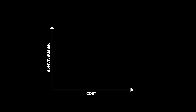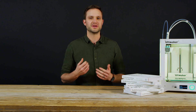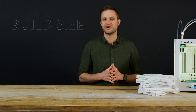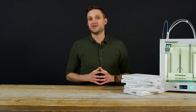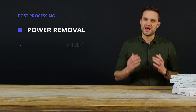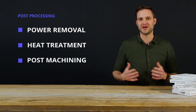In simple terms, metal 3D printing is really only justified if you're going to see a big improvement in performance. Another limitation of metal 3D printing is the build size. The maximum build size for most metal 3D printers is only 200 millimetres cubed, so you should keep this in mind when designing your parts. Metal printed parts are never ready to use straight off the build platform — every metal 3D printed part requires some form of post-processing, be it powder removal, heat treatment, or post-machining, and all of this adds to the cost and lead time of production.